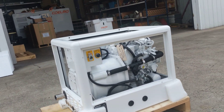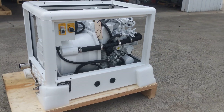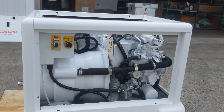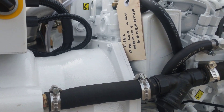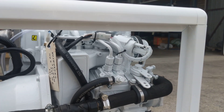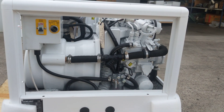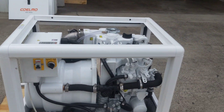These are a 6 kVA unit at 3000 rpm. The reason they're at 3000 rpm is because they can use the Kubota two-cylinder engine. The exact model of this engine is the Z482, which is a very common engine — extremely reliable and extremely lightweight. Perfect for a lot of small applications and any small vessels where space is the biggest issue.